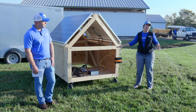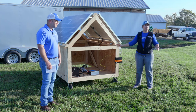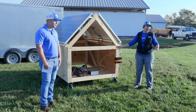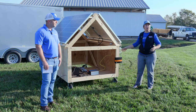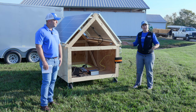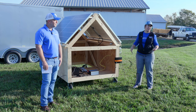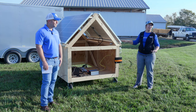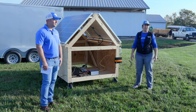The inverter also inherently has a little bit of inefficiency. Some people will actually run lights and things like that on the DC side — those fixtures are more expensive to purchase, but there is an inefficiency going through an inverter anyway. It's not terrible and it continues to get better. Generally, cost-wise, it's worth it to run it through the inverter to avoid paying for DC-specific lights. All of these components continue to be developed and the cost continues to shift.